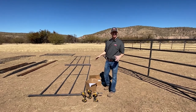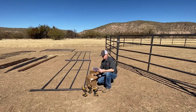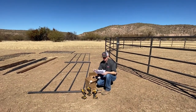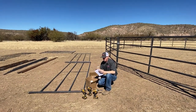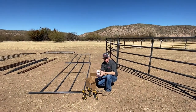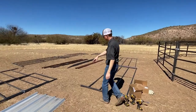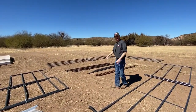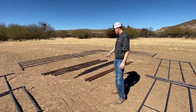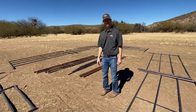To get started, I'm going to show you what a shade kit comes with. When you purchase a shade kit from us, you're going to get the instructions — written instructions right here — that go step-by-step to help you install it correctly. It's going to come with a box of 50 framing screws, a box of 10x10 screws, and we'll show you what those go to in a little bit. Panel clamps, four pieces of tin, and all the framing material for the trusses and the frame of the shade. You're going to have three outer frames, two trusses, and four posts. And we're going to get started now and start putting it all together.